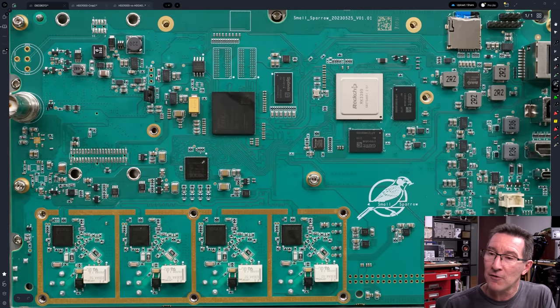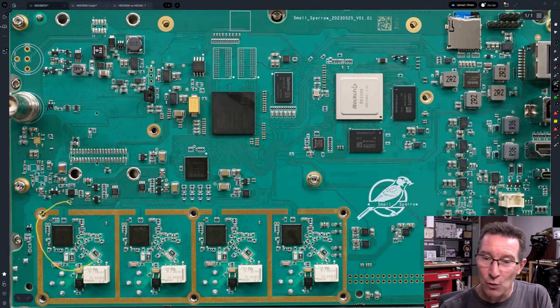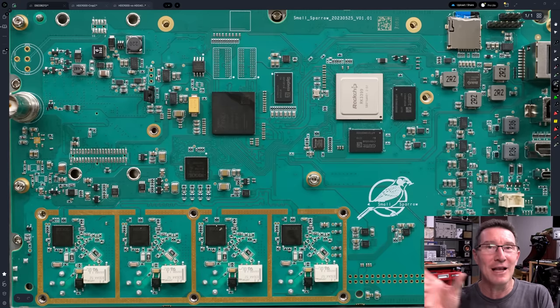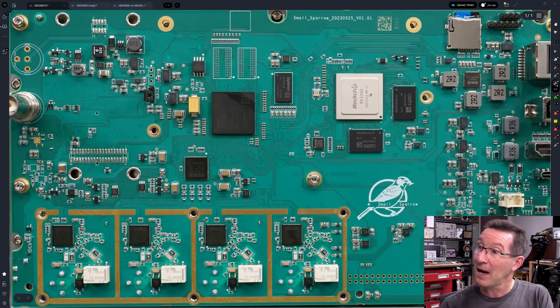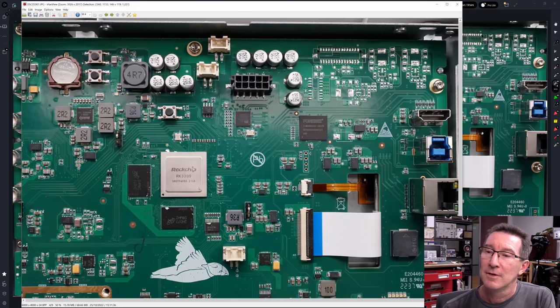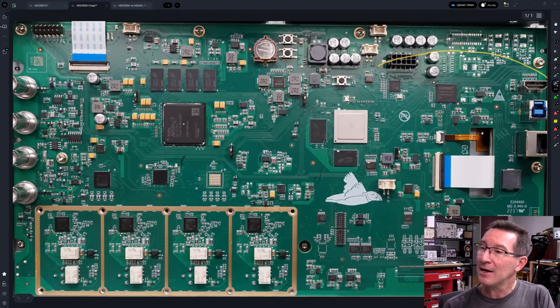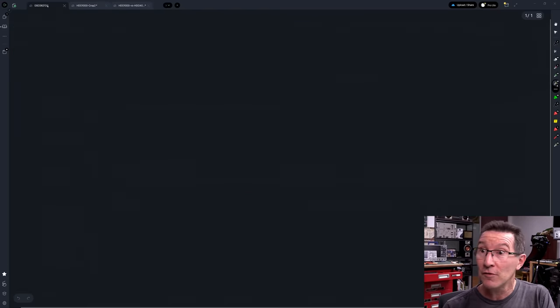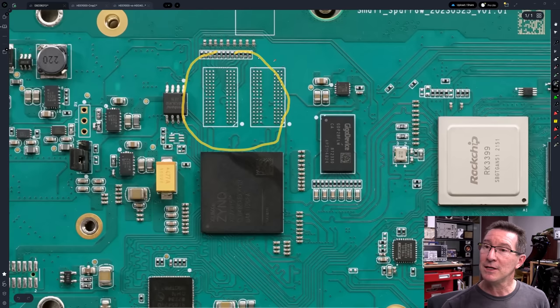It's exactly the same analog-to-digital converter as used in the other ones, but you only get the one. So you turn on all four channels, they all feed in — you can actually see the differential pair outputs, trace-length matched so they're all equal timing going into the ADC. This one is 1.25 gig sample per second, so divide that by four if you turn on all four channels. There's only one, so you can't do the trick of interleaving channel one and channel three as on scopes with dual ADCs. That's how they reduce the cost.